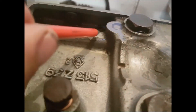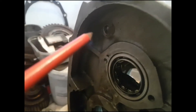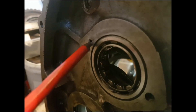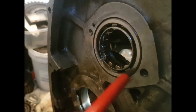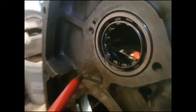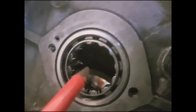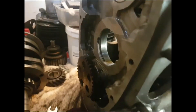It makes its way along here to another inspection hole, then straight down — squirts out through this hole which goes behind the bronze plate. The bronze plate has two slots in it so it doesn't matter which way around you put it, and it trickles in to feed the camshaft bearing there. The one you can't see at the moment, further over in the distance, is fed purely by splashing oil from the crankshaft.